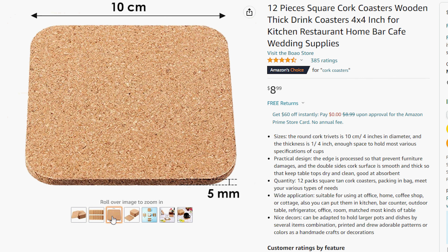I also wanted the boxes reasonably close together so the laser head wouldn't have to travel further than necessary on each pass. We have CorelDRAW's default line color set to red, which is the color we use for cutting through materials, so I changed the squares' lines to blue, which is the color we use for marking materials. The artwork needed to be laid out in the same position as the coasters, but I didn't want it to engrave at the same time as the marking on the chipboard — toggling what does or doesn't get cut or engraved in the laser software is asking for a potential mistake. I'd rather send separate jobs to reduce the chance of error.